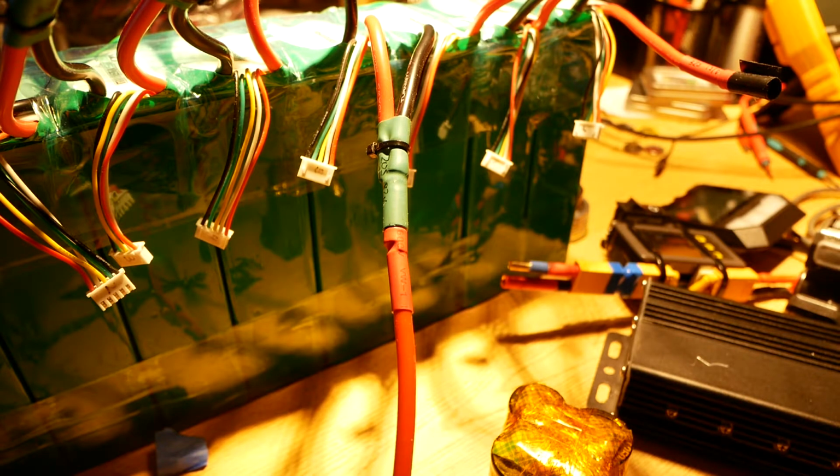Instead, every time you plug in your wheel, you get that big pow. And if you're not careful, and you accidentally discharge it without hitting the power button so that they bleed out slowly, then you get another big pow when things discharge rapidly. And all of that is very bad for the electronics. It will kill it eventually. I've been building EVs for 5 years, and before I knew about pre-charge, I killed 2 cheapy controllers doing that. They just simply died after several of the big sparks, and that was that. So anyway, this is a bad thing.